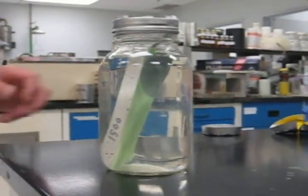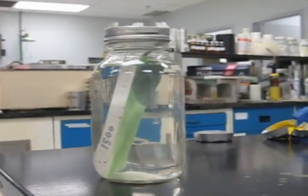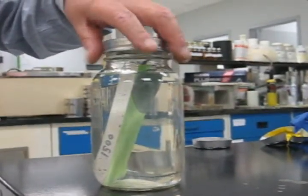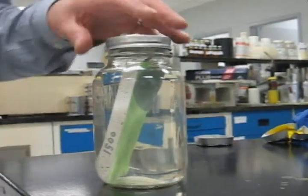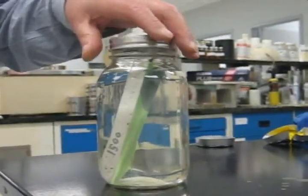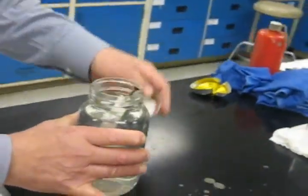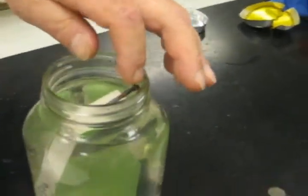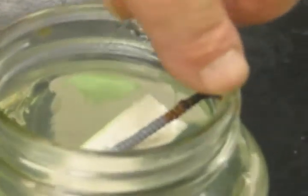What we did here is we've got exterior gypsum core exterior sheathing, which we dipped to coat all sides — including the gypsum — with Bontac 1500. We immersed it in water for three months. While I was dipping this, we used a screw to hold it and dip it into the actual Bontac 1500.